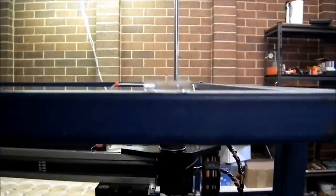I also seem to have fixed the issue where it doesn't cut quite parallel. If you turn this around you'll see that it's fairly straight. Before I was having an issue where it was cutting downwards like that on each side, but I seem to have fixed that now. And as you can see, even at 5mm a second it's gone through enough to burn into the MDF. I do seem to have a few little inconsistencies where it didn't burn quite through.